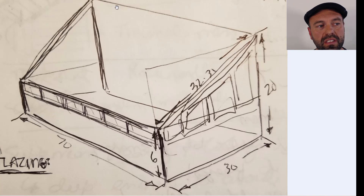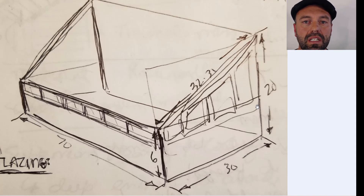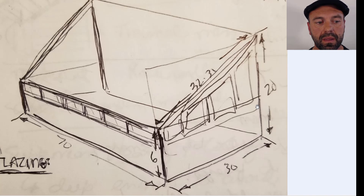I'm not seeing any top vents, which are really important in order to get a good thermosiphon and good ventilation throughout the greenhouse. I'm also not seeing any door details, but they may not have included that at this phase. It's really great to have doors on both ends, or at least a door on one side and a blowout panel on the other. There's an interesting window detail here — it's probably quite doable, however it might make the framing a little more complex, so you'll want to look into the cost of that before you submit.